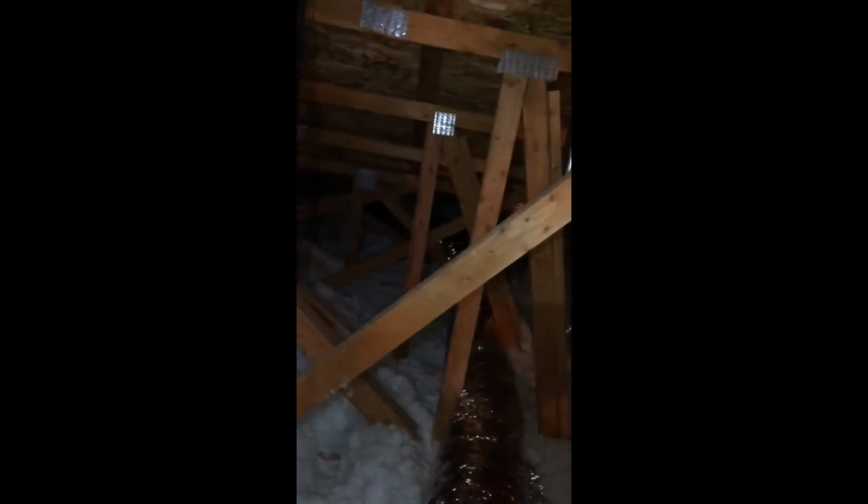I'm now going to cover this duct with this insulation here. I put more mastic than I need on here so that when I lay this on, I'll pull this up, zip tie this, cut a little notch so you can still get to the damper, and then this will be a new 10-inch run installed on this unit. And you can see it is way over there, clear to the entrance. So that's a 25-foot run of 10-inch.